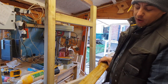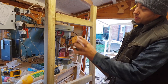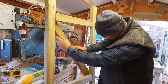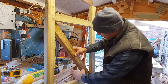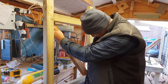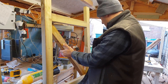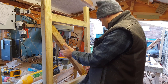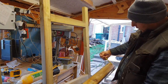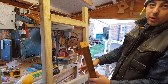I thought I'd show you a quick little tip as well. What I've done is I've marked the centre of the brace on each end and I'm going to line that up with the corner of the rails going into the stiles of the gate. Now you can clamp it but I'll just put it tight towards me like that. You just mark it, and then you've got the length of the cut and you've got both angles. Take that to the mitre saw and cut them.